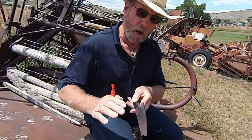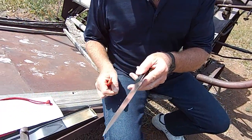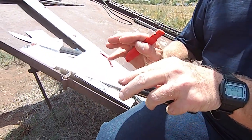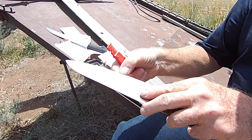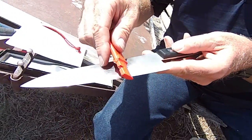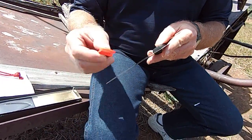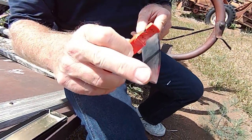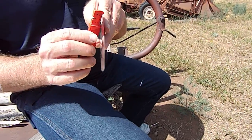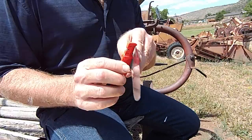So on this particular knife, it's got about a 5 degree bevel on it. It's really thin, and it's almost a Scandi grind. It just comes out of the sharpen. There's no hollow grind or anything like that. There's a little teeny tiny secondary bevel right down there that is about 5 degrees. So you're gonna set it on there as low as I can get it, and then I'm just gonna brush along lightly from the hilt back here to the point of the blade. Set it on there about like this. You can see it's really a small angle. It's probably 5 degrees or so.